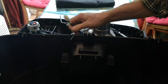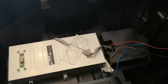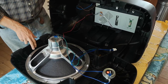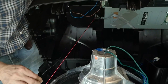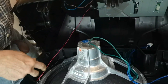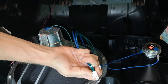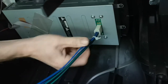Everything's in and ready for the next stage — putting the fascia back on with the speaker units and drivers. The cable isn't long enough to reach easily so you need to do a bit of a reach around. As you look at the base of the speaker, plug the red wire into the right side of the JBL icon indicator and the black goes on the left side. If the indicator isn't working, don't assume the connections are wrong — there's a switch on the back that may be switched off. Then reach inside and plug the main speaker connection loom connector home until it clicks, and give it a pull to confirm it's locked.